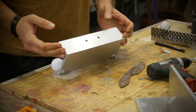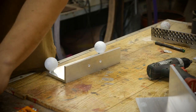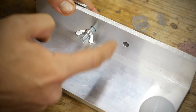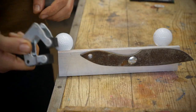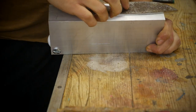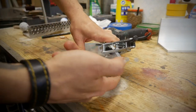This is our grinding jig — it's ready to use. A few tips on mounting the knife: use the bolt and the butterfly nut. I recommend using a clamp like this because the knife cannot move while grinding. Movement will screw up our plunge line, and the plunge line should be perfect in every knife you make.